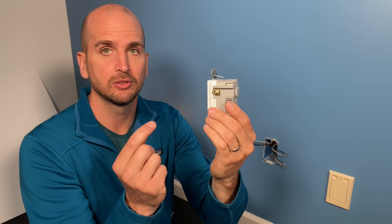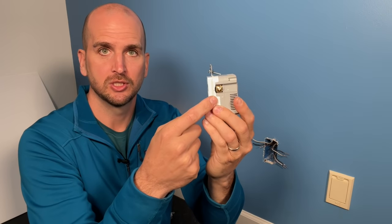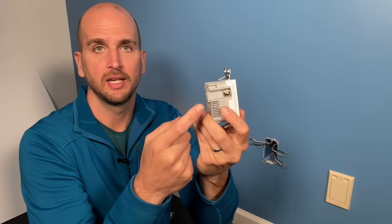With the smart device, you only have a single screw terminal for hot, signified by the gold screw, and the silver screw is for neutrals. You can only take a max of two wires on each of those screws, so in this case with three sets of wires coming in, we're going to need to do something different.